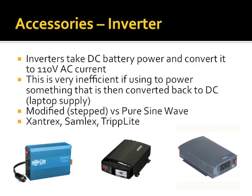A lot of the modern laptop power supplies, USB chargers, your iPhone charger, they really don't care as much. They've got enough stuff going on inside of them that it's fine. The ICOM 92AD, the little wall wart that it comes with, it will not work on a modified sine wave charge inverter, at least none that I've tried it with.